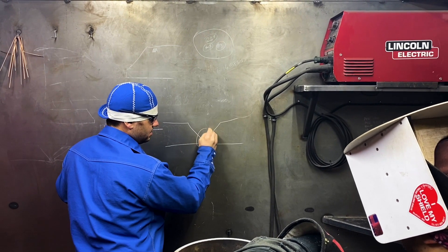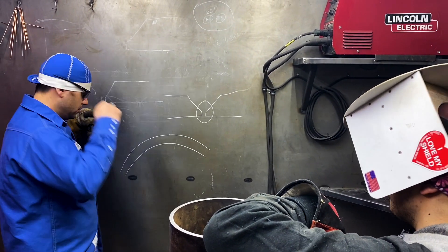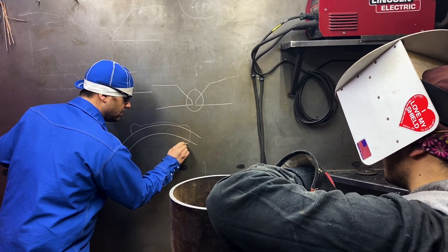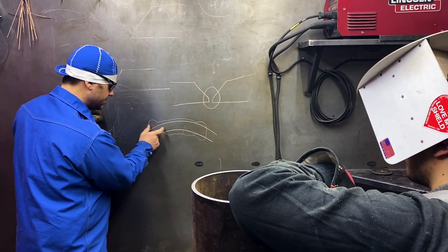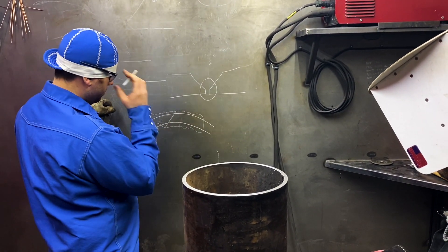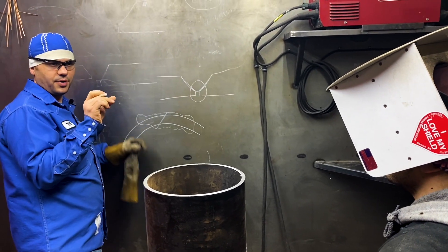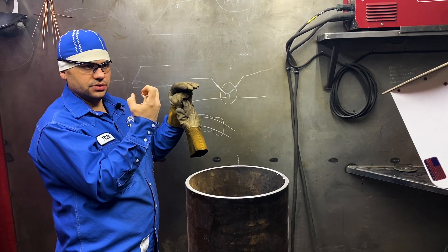You put this tack in just like that. If you were looking at the end of the pipe looking in, you'd have that bump where you lit up and held it just for a minute — you didn't push in quite yet because the rod wasn't heated up yet. Your tack has this bump that comes along, and then there's a keyhole, and here's the inside of the pipe where you've penetrated, and then right about there the metal comes up. So there's no penetration right where you lift the tack up, so we've got to grind it. You've got to take all that metal out. When you do your grind, you want to follow the line of the pipe, because you don't want to take this land out. That's one of the problems — guys get to the tack and they've ground that land down to nothing, so they get up there doing their root pass and there's nothing to weld to. That land holds your keyhole through your root.